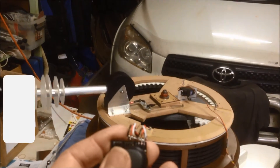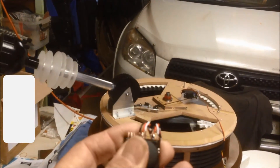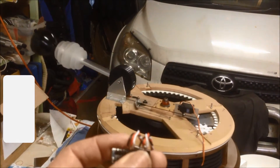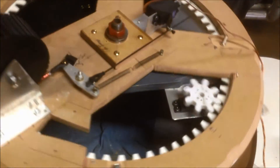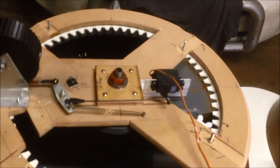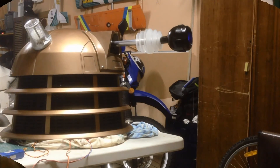The neck and dome — you can see it's controlled by a joystick that drives into an Arduino Nano. Dome rotation is done by an 886 sail winch servo, and the eye is driven from a medium duty metal gear servo. Components include the Arduino Nano, joystick, five volt power supply, a five volt regulator, and 12 volt battery.